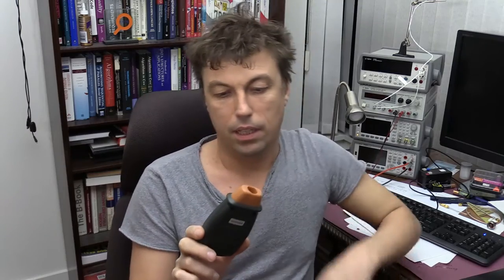The principle behind this digital tachometer is quite simple. It's just a diode laser or a powerful LED with a photodiode or a phototransistor sensor, which is used in order to sense the reflections of a spindle or any kind of rotating machinery. And in order to make this tachometer work, usually you have to attach a reflective tape. Some of the more expensive units do not require you to do that, and they can actually distinguish between the noise and find out the real RPMs within the noise. So with this one, obviously cannot.